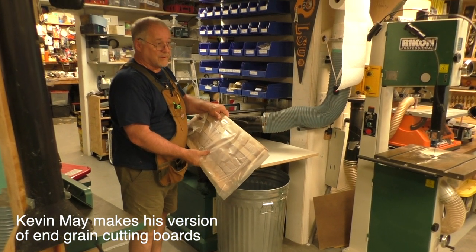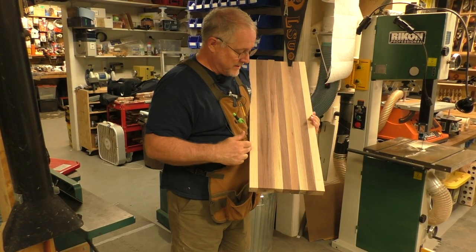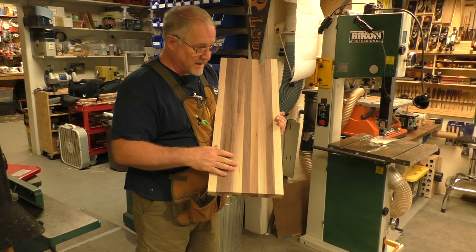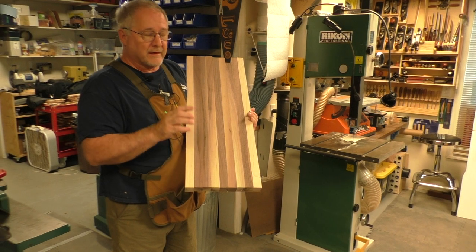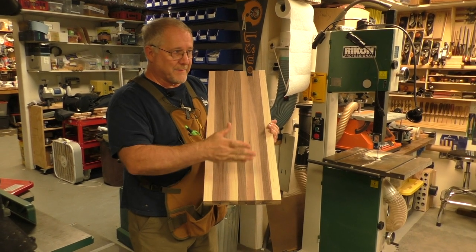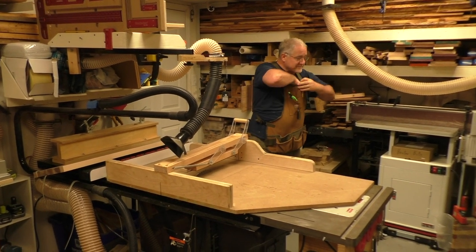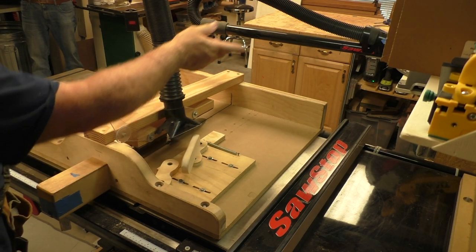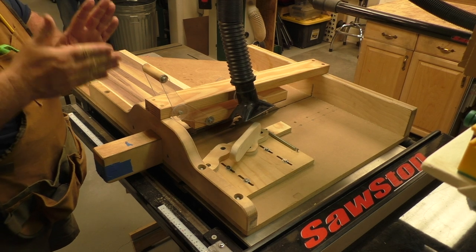Here I've got a completed plank I would use in a cutting board — this one is going to be part of an end grain cutting board. It's two maples and black walnut of various grades, sapwoods and heartwoods, so I've got different colors. We're going to cut this into little slices and turn them up on end to make an end grain cutting board. The next step is the table saw sled customized to make these very accurately. When cutting these planks, you want a very consistent length — if not, when you glue up the end grain strips, you've got a tremendous amount of sanding.